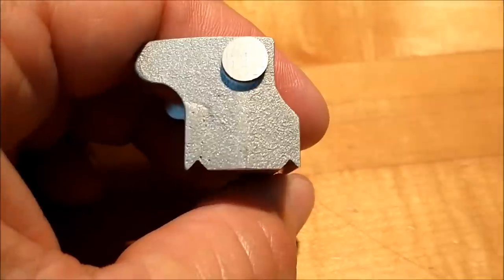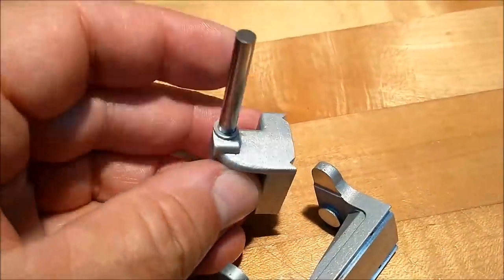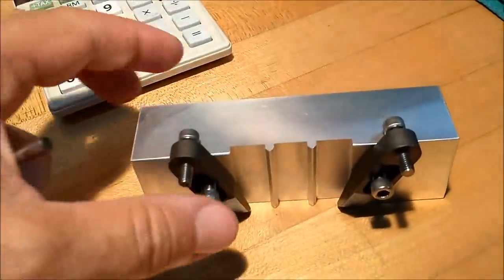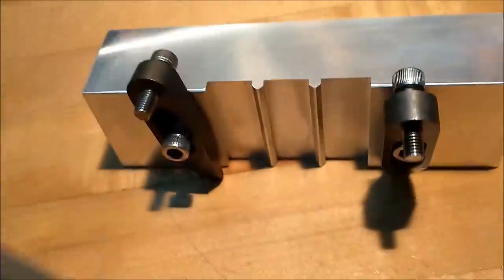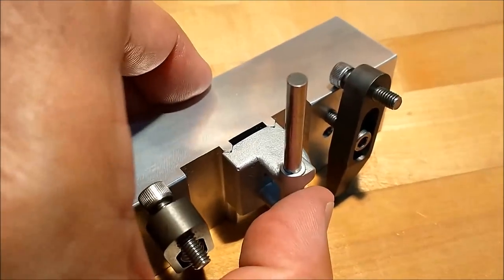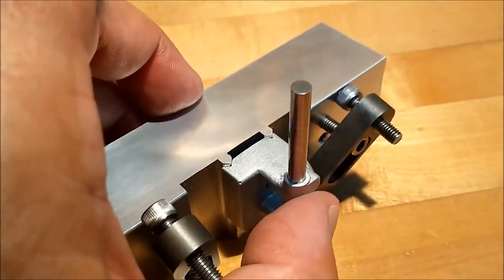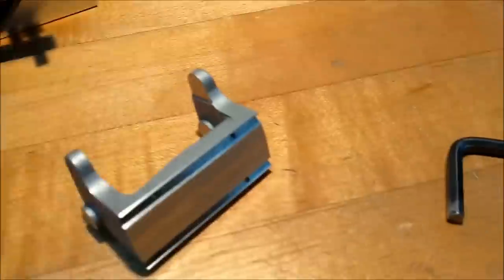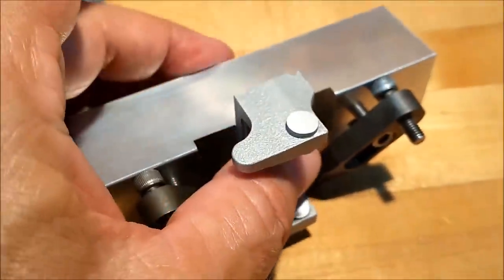So the thought here is to locate this part, driven by the location of this part, registering on the dovetails. We're going to do that with this fixture right here. This is a little mock-up of the ways. I'm going to load this in the machine using the tailstock as my center of the universe, resting on those V's. As soon as I have this pin indicated, I will swap over to this guy right here, drop him on the exact same fixture,